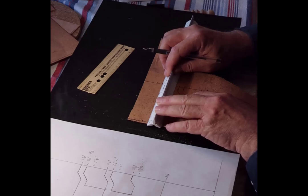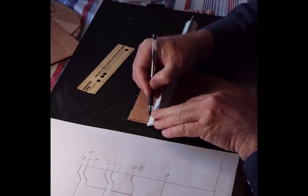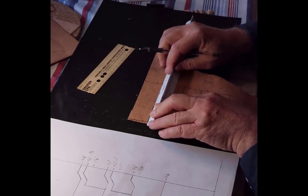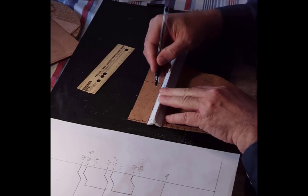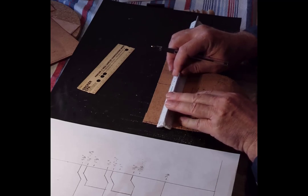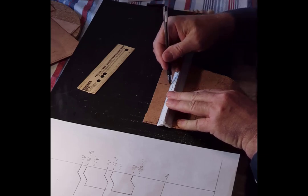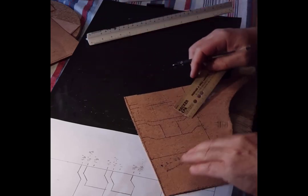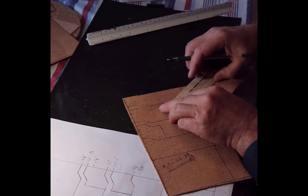Step up to the next one, and this is going to be indent 5/8 inches. And 1 1/8 inches. And that's going to be at a cross line. So 5/8 inches from the right, and then 1 1/8 inches across. And then come up to the last line, reference line we have, and that's going to be 5/8 inches. And I indexed that one because I went a touch too far. Now I can take a little ruler, which is really handy. Draw the diagonals.